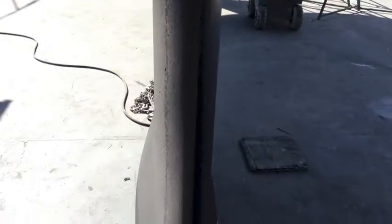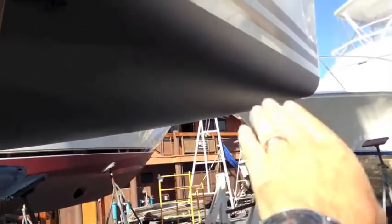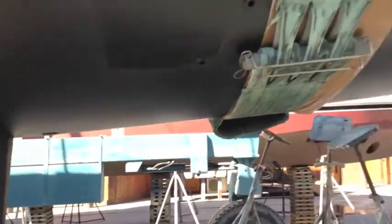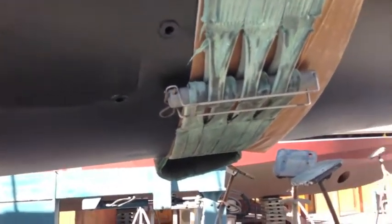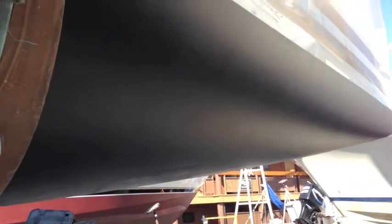This gives you a really nice look at the keel styling and design. Coming up to the bow — similar to how the transom was — if you take this flat line edge and carry it all the way forward, you can see how the bow itself has a nice reflex to it. This is a rocker camber style shape, allowing you to come into oncoming swells and ride the ocean much better. When the boat heels over you pick up waterline, which increases performance and speed in how you enter the water from the bow.